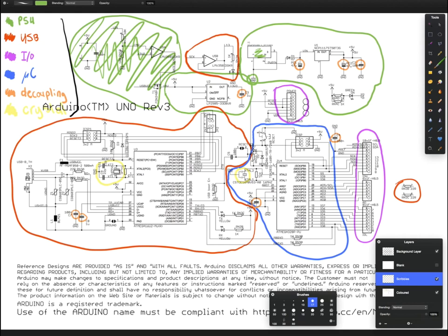So basically anytime you see another ground on the circuit, like here or down here or here, basically, all of those need to be connected on the PCB, and that's what it's indicating in the schematic. You can also see net ports like this. This one's 5 volts, and you can also find one here, and here, and heaps of other places. So, same deal applies. They all need to be connected together. The last thing is, if you see a label on a wire, that's actually the same thing. So, this V in here needs to be connected to this V in here on the PCB.